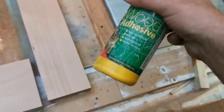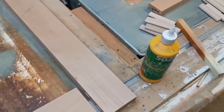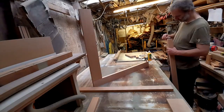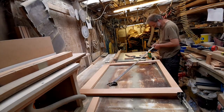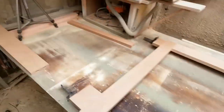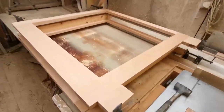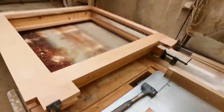I'm just going to use regular wood glue, PVA wood glue. The only PU glue I've got is that 5-minute stuff — it can go off way too fast in there, it's toasty warm. Alright, I've checked it for square, put that to one side now, do the other one — done. I remembered to make the one that goes against the wall a little bit wider so I've got room to scribe it. I'll leave them overnight and let them dry properly.